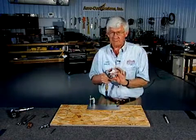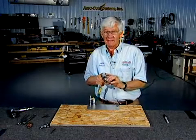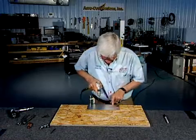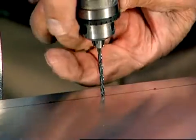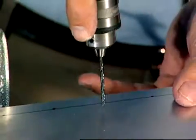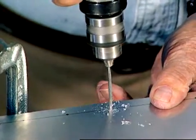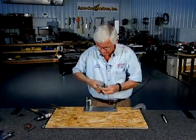A word of caution: never work with your drill — removing a drill bit or putting one in — if it's still connected to the air, because you can get serious injuries from that. So let's start somewhere close to the center. You can see I've got the holes laid out, and I don't want to walk this drill all over the material, so I'm going to turn it by hand about a round or two before I pull the trigger.